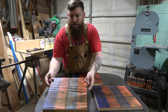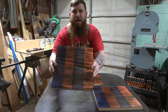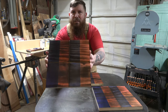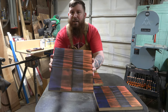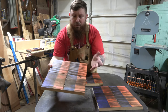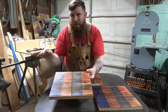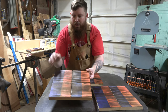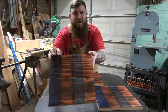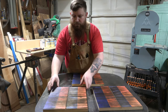To be honest, I think I've really got to give it to Varathane on this — it's just so much more even, the colors are much more even, and it was just much easier to apply being thin like that. Up until this point, all I've used is the old Minwax stuff, and this was kind of surprising to me. I've seen pictures of Varathane online and never was that satisfied, but trying it here on my own it came out great. I never torch first — I always torch after, because I like being able to read how that grain is going to look coming through the color. With Varathane it came out great, and I wouldn't be surprised if I end up making the change to just using Varathane from now on.